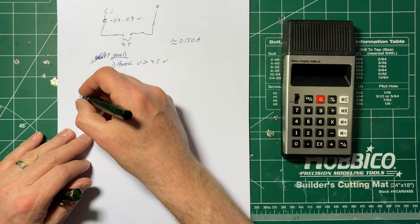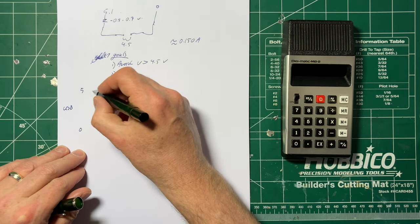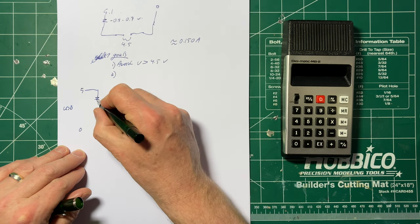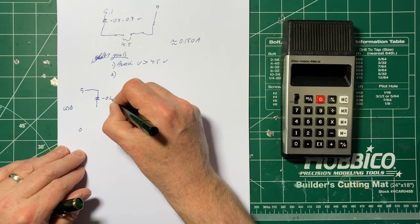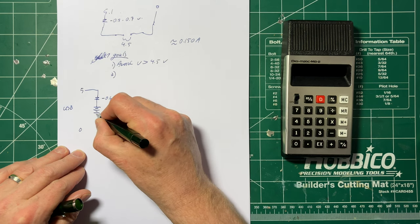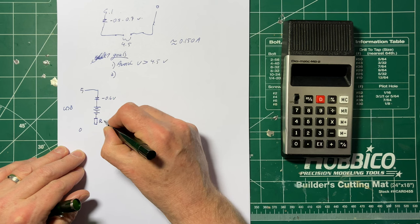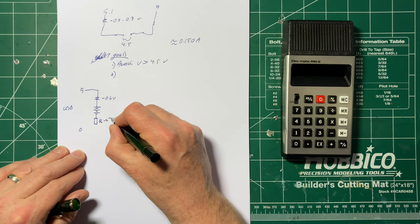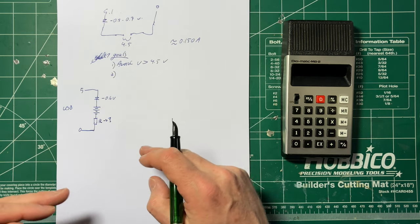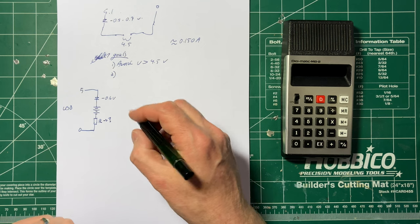So let me explain what the circuit is. Five volts, zero volts — this is from the USB power supply. We'll come in, put in the diode, so that's minus 0.6 volts. Then we'll have the battery — three cells. Then there's a resistor. The question is: what is that resistor value? We need to figure out the voltage across the battery and what current we want, and then use Ohm's law.